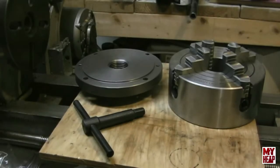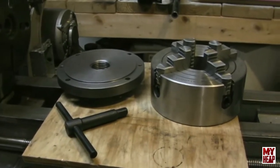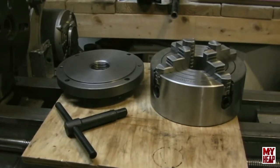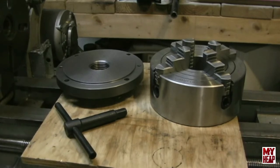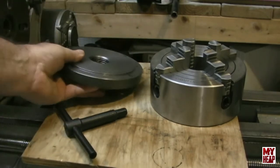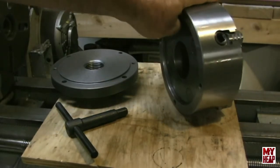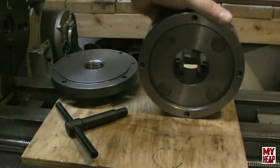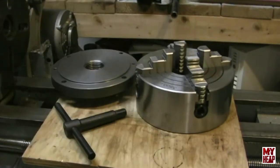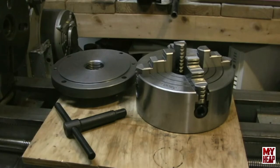Hey guys, Joe Hildreth here. In my last video I was working on the bearings on the counter shaft, and I said I would put out another video with some of the stuff I've recently acquired for the lathe. So the first thing I have here is a four-jaw chuck and a back plate. The step on the back plate will have to be turned down to register in the back of the four-jaw chuck. I've always understood that if you can only afford one chuck, get a four-jaw. I don't have a whole lot of experience in turning and I have to turn this step down, so we'll talk about that in a moment.